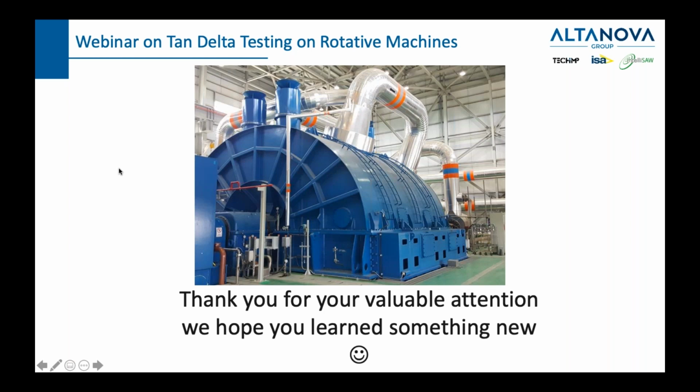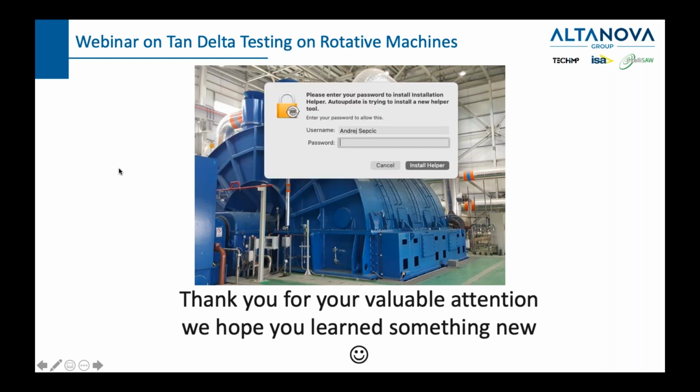The tan delta is reversely proportional to the conductivity. The more this insulation is conductive, the tan delta is higher. Sorry, it's not reversely proportional, it's directly proportional. So long story short, what does it do? It additionally polarizes the water molecules and the molecules of impurities in order to make it more conductive. That's why you see this.